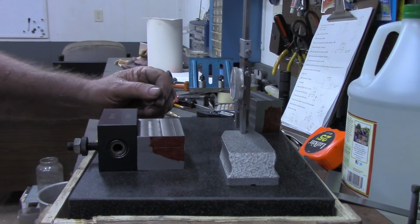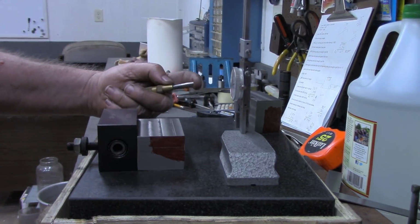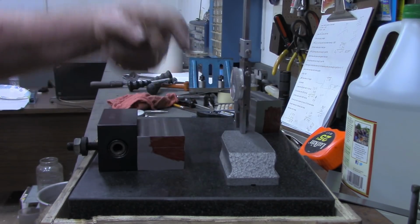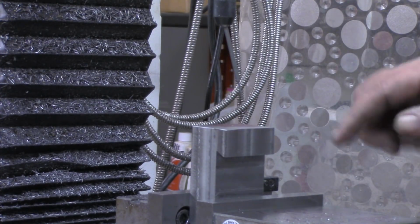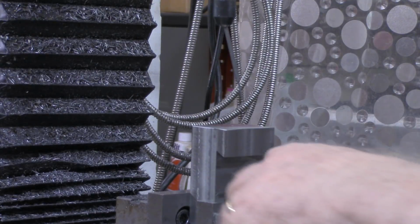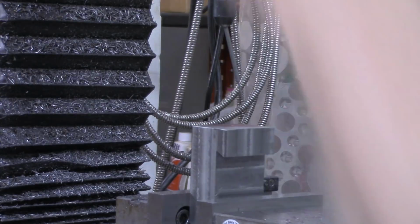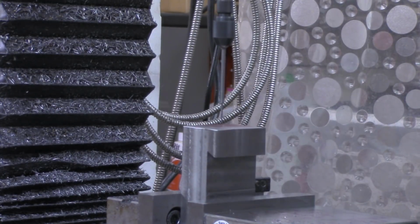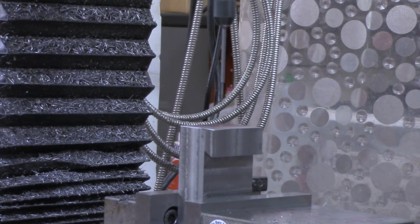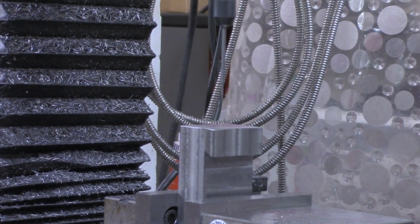All right, I'm gonna get a little center punch on these. Then I'm gonna finally go over to the mill and drill them out. I'm gonna use a wiggler to locate the center punch that I put over there on the workbench on both of the pieces. That'll be plenty close enough for drilling the hole all the way through. Lock the table down and zero out the DRO.